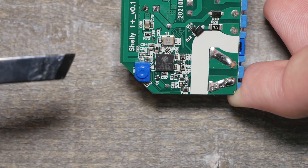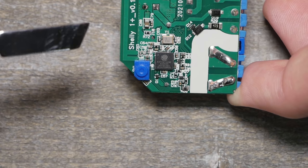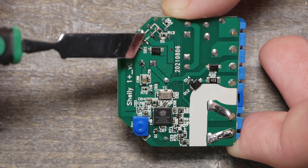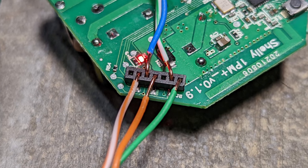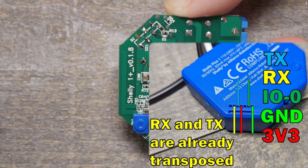You're probably asking: can we flash this? Absolutely — I've actually flashed this with Tasmota and have it working. The template and everything you need is in the description. I did have to figure out the pin header, and I did end up ripping it off, but I just soldered directly to the pads. I'd recommend using small solid wire instead of breadboard jumpers. The button is also mapped — you can use it in the template, including for the 40-second factory reset.